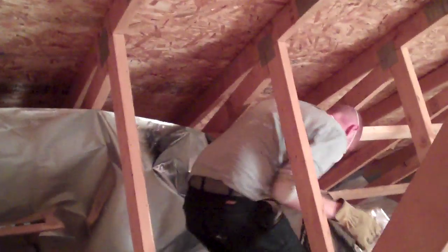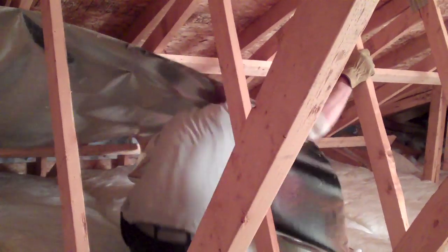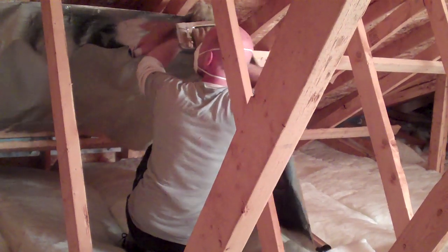As with any pitched roof design, you want the first run of material down at the bottom, close to the eaves. Generally, 6 to 8 inches above any installation where the rafters meet the eaves is ideal. Leaving this airspace is critical for good ventilation.